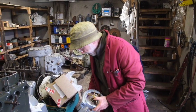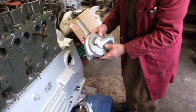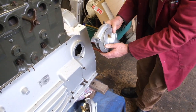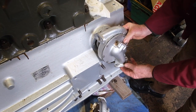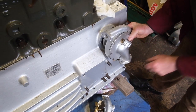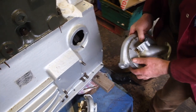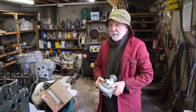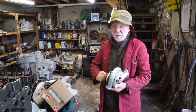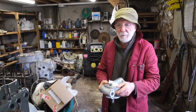And you'll see them, so you can take action. It's all very simple. This is a complete pump here, ready to be fitted. That goes on there like that. Water comes in here, right around the block and up. And this is a bypass circuit here — I think we explained that more fully in another video. Very, very simple technology. Goes for years without giving any bother.